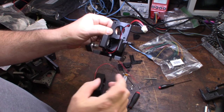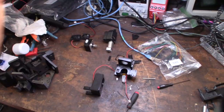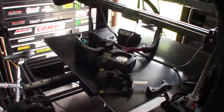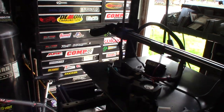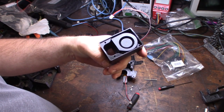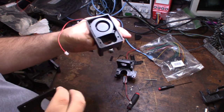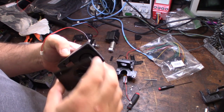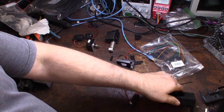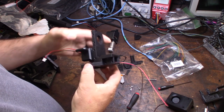I love having the LED right near the hot end so when I'm zoomed in on my camera I can see the part, even with top lights. Here's a closer look at the 4020 fan area — the blower feeds back through an aerodynamic channel. One thing you don't want is sharp edges because they create whistling — that was actually one of the problems with the Voron extruder.